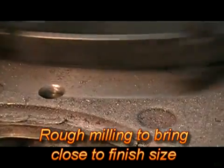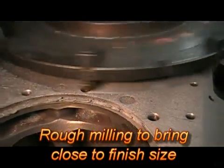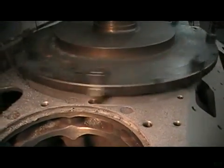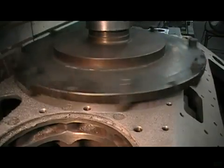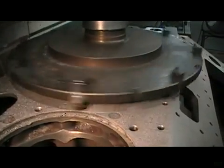The initial machining process is similar to machining a raw casting. The deck is rough and very abrasive. During this process, our technicians restore all proper deck angles, concentricity between the upper and lower bores, and also the height of the block from the front to the rear.